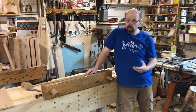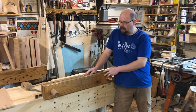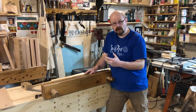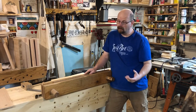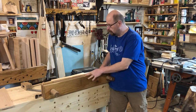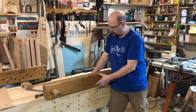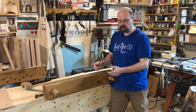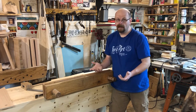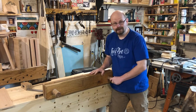For a lot of woodworking, I do want to push you towards making yourself one of these Moxon style vises — great little double twin screw vises. They're not necessarily a vise on your bench because it's something you can apply to the bench and take off again. I move this from one bench to another around the shop. It attaches with a couple of holdfasts on a little lip in the back, and it raises my work up so I'm not bent over as much while cutting dovetails. But we're not going to have these on the benches at Tunnel Mill in May.